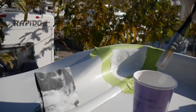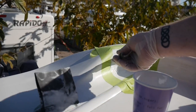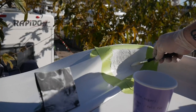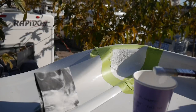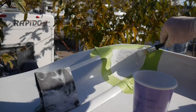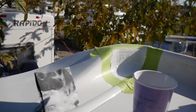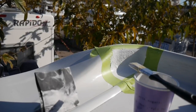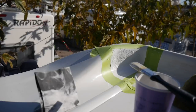One thing to bear in mind is that you don't need to be overly fussed about getting this bit looking great, because it's all going to be sanded back and then finished off with the gel coat. I'm just going to pop another chunk of resin over that. I've got to say this feels actually too easy at the moment — and maybe it is.